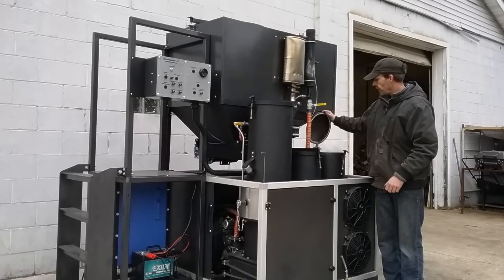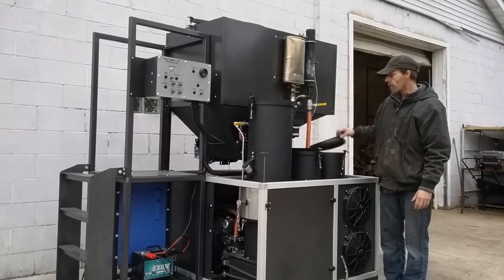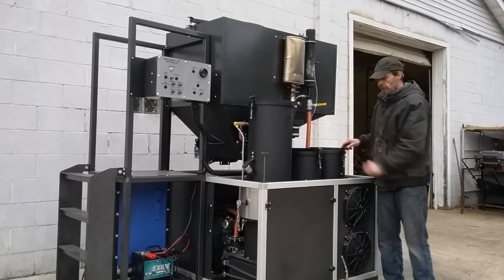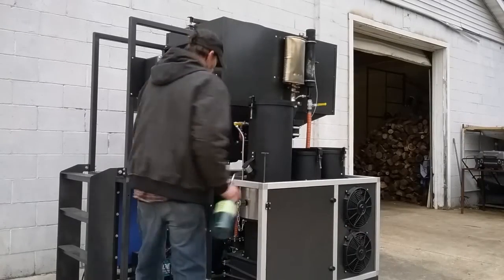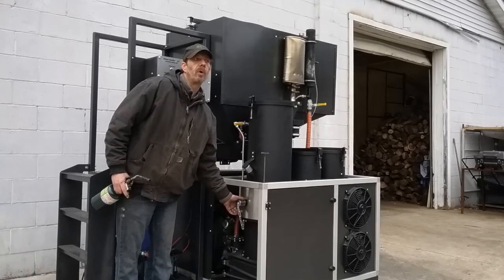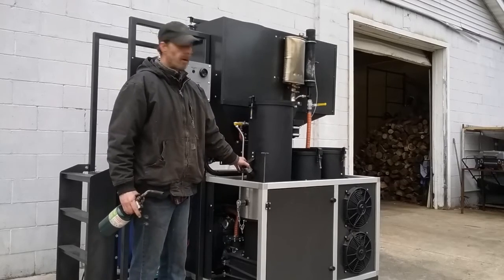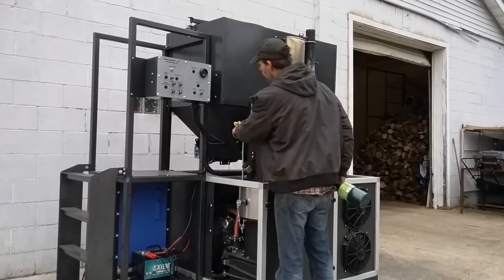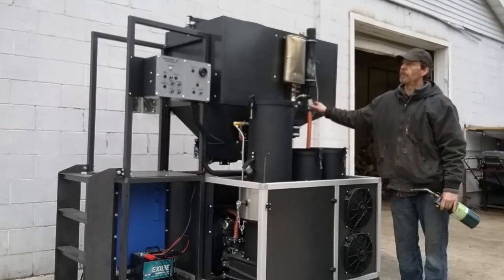Open the lid and you've got full access to it. I'm going to get started and show you how to operate the machine. This is your main air intake to the gasifier unit. When you're in run mode or vacuum mode you'll have this removed. This here is your ignition port, your air supply to the flare tube, and your gas supply tube.